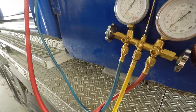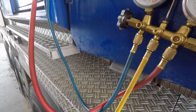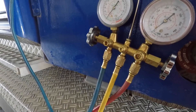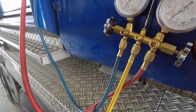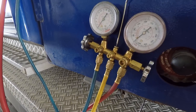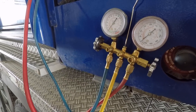It's important to note — and you can tell by looking at the gauges — there's no refrigerant in this system. There is a federal law against knowingly discharging refrigerant into the atmosphere. If there was any refrigerant in the system you'd have to use a reclaimer: a vacuum pump hooked to a tank that pulls the refrigerant out of the system and stores it, putting the system under vacuum without losing anything to atmosphere. This system, however, has lost all of its refrigerant over the course of the winter, so there's none in it.